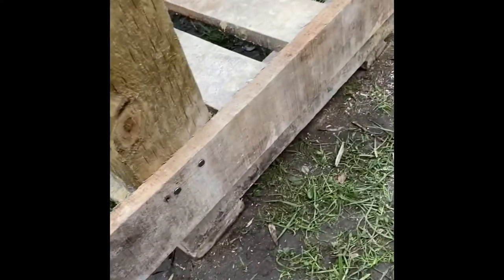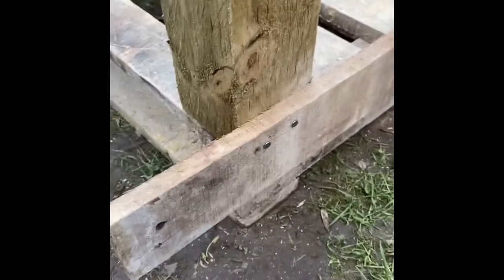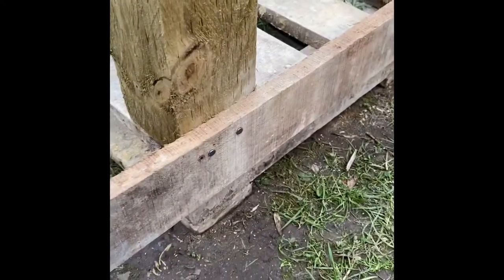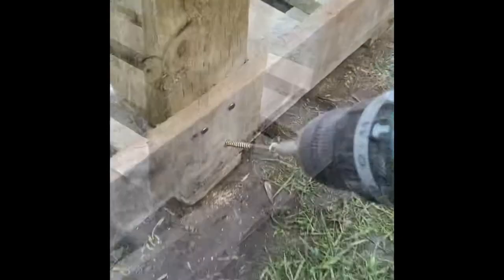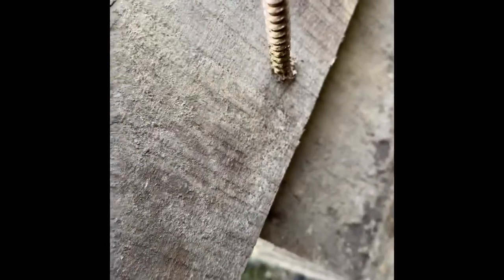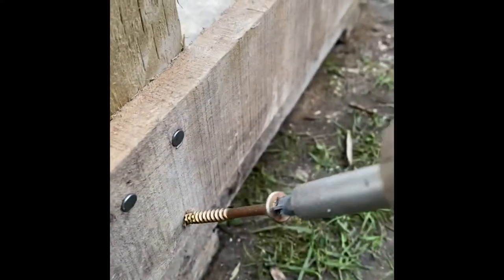Just like that — make sure you don't leave any rusty nails around or you'll have to go get a tetanus jab. The first part I've pinned in with some nails, now I'm going to screw in the bottom part — it's half in the top pallet, half in the bottom pallet. I'm going in at a diagonal, straight down into the block. I didn't want to go too low in case it splits.